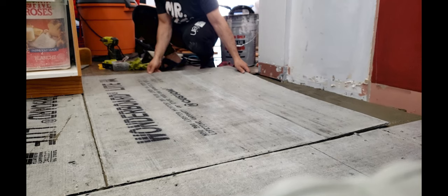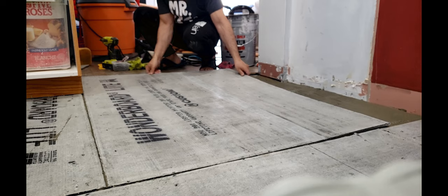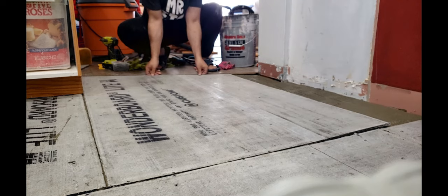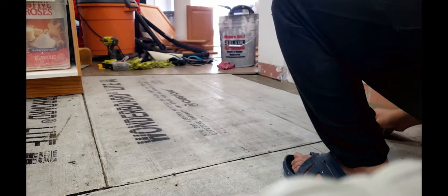Once you are ready to set your board in place, make sure it's first aligned within the spot before you drop it down. It's okay to collapse it to remove any air bubbles, but you don't want to drag it left to right and move all your thin set that is underneath the board. Again, don't forget to leave 1/8-inch gaps around the perimeters as well as between your boards, which we will fill in the last section of this DIY video.